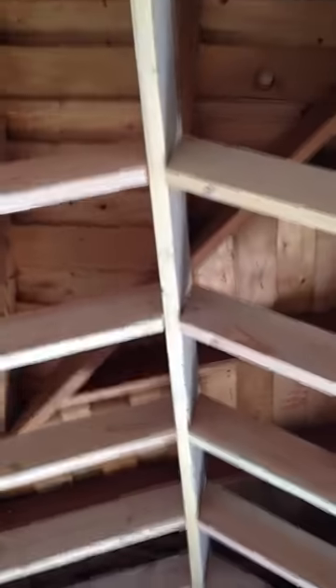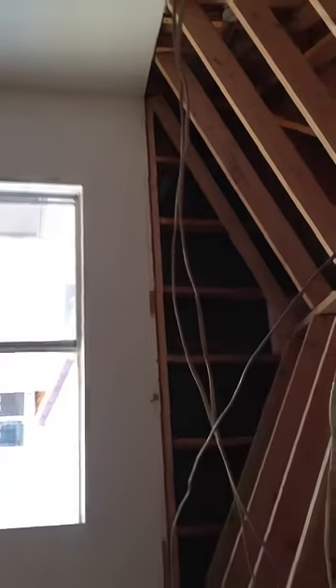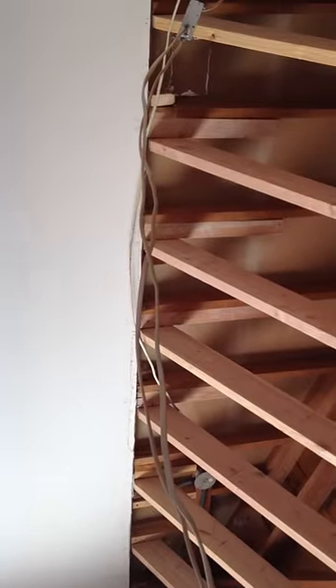One of the things that we can do to make the rooms look bigger is to go with vaulted ceilings. Here, as you can see, we've already done that — we have two-by-six joists going up at an angle to the main ridge beam at the top, and then being supported down at the top sill of the wall. This look makes the room look nicer and bigger, and once we put the drywall in it'll look really big.